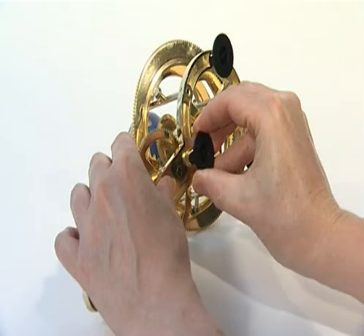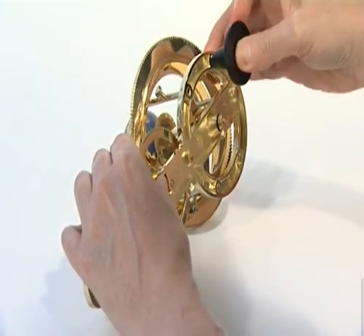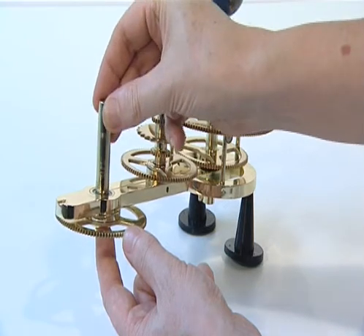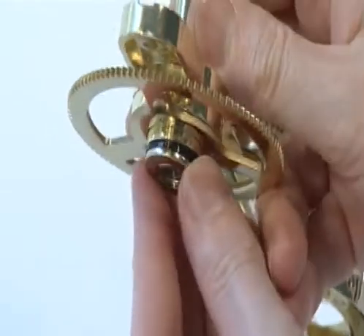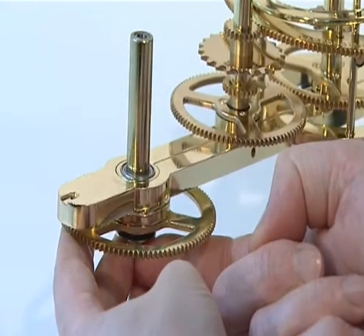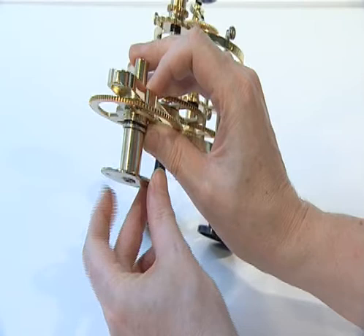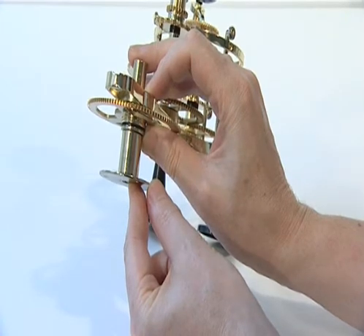The second phase of Stage 3 adds the central column and shaft, supplied with issues 22, 23 and 24. Remove the short temporary plastic feet from the underside of the earth arm and replace them with the new larger feet. Slide the central column through the central column support collar and through the large plastic washer and large brass washer. Ensure that the two pre-fitted 8mm steel bearings remain in the central column at the top and bottom. Slide the central column support onto the base of the central column, making sure that the wide flange is at the base and flush with the bottom of the column and bearing.